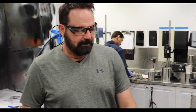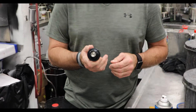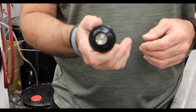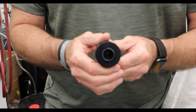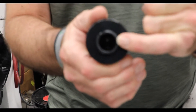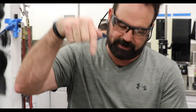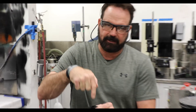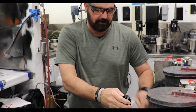Really what I want to talk to you today is about when you fill these cans — this is one of the heads that's used in the filling process. Inside of there is a little ball, and that little ball seals it, so that when we depress the paint, it presses that little ball down and fills the paint into the aerosol can.